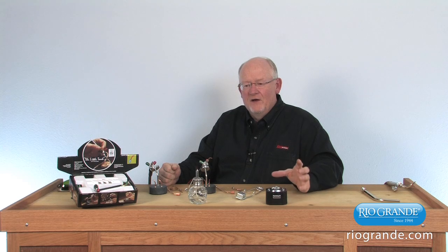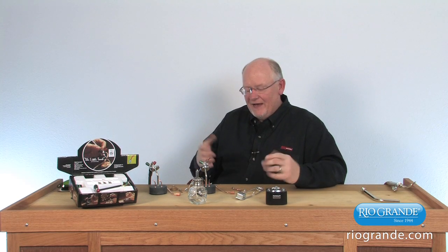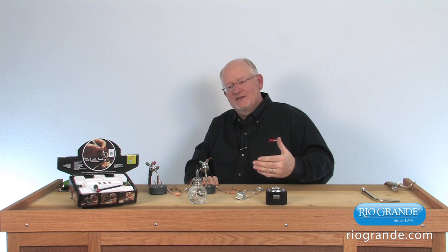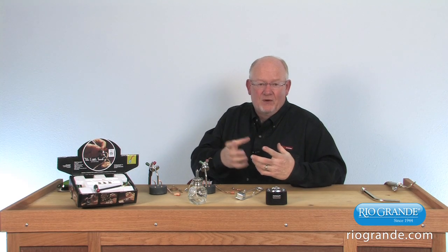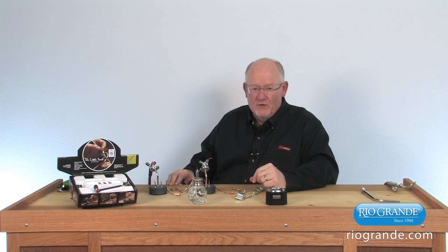It's good to note that the little torch has tremendous flexibility. It's very small, and it would appear not to be able to do a bigger job, but it actually has a great deal of flexibility and is sort of a do-all in the jewelry industry. So it will work for very small projects, clear down to a watch safety chain, up onto larger, perhaps a bolo or a belt buckle. This torch will actually even cast up to 3 ounces of gold or silver with multi-flame heating tips, or some people refer to those as rosebud tips.